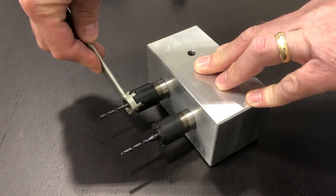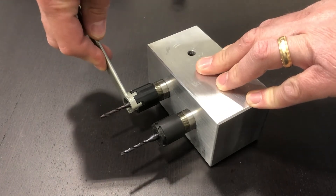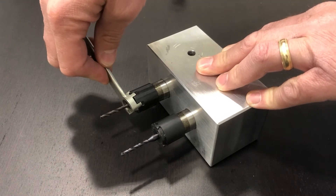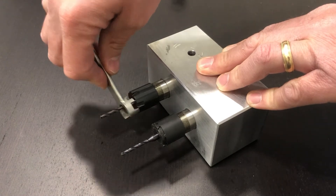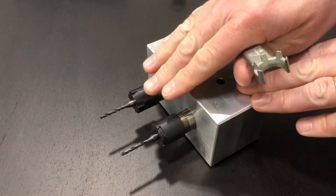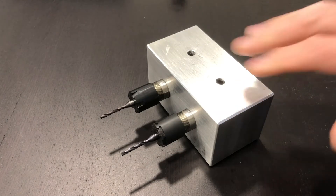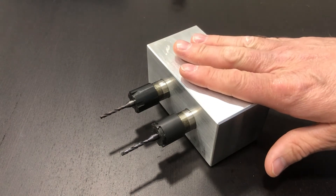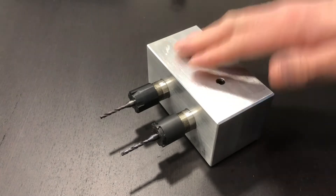There's nothing to keep the operator from holding it at an odd angle, and that odd angle is what usually happens. The operator applies pressure and bends the wrench or slips off of the nut itself. Most of these assemblies are used in Swiss machines, and when you slip off, you can easily break the expensive cutting tools or, worse yet, hurt yourself in the process.